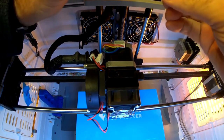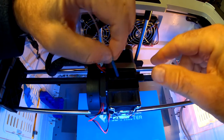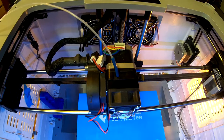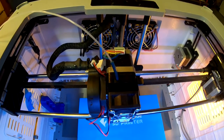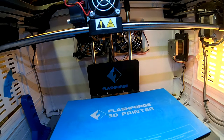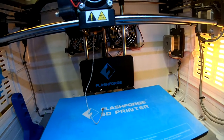All right, it's just about heated up. We're going to feed it through the top like we normally do. I always run my filament through this little short section of Teflon tubing to keep it going in more straight and prevent erosion around this little hole. I'll press the load button and we'll watch it go through. It should be silver coming out to start with and clear. Then we'll set it to 240 — it's at 225 now — and run it some more.